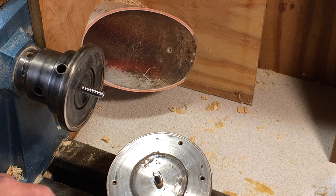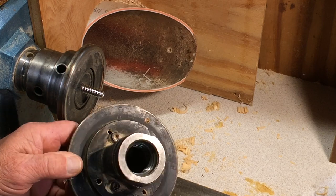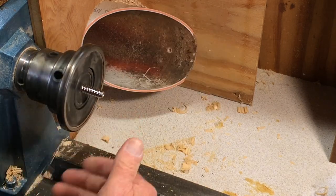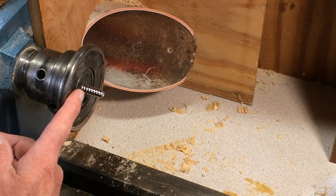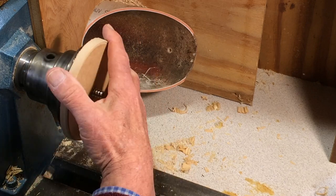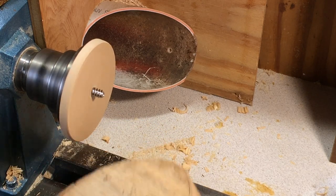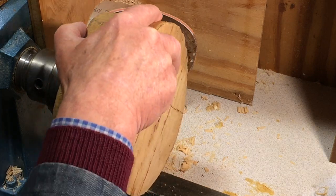For the past probably 40 years I've been using a glazer screw — first in this, which is an adapted and made-up screw chuck, and more recently I've used this Picmark 3-in-1. That collar comes off; at the moment I've got the larger diameter, but if I want a smaller diameter backing plate I can just reverse this collar. I don't need that much screw, so I have a spacer which goes on — MDF — and then this backing plate, just over 6 inches. Same thing again, and that still doesn't want to come off that easily.